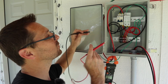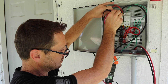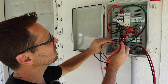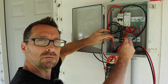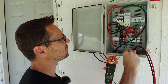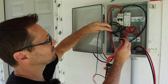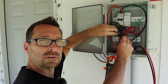I'll show you what we've got coming into our breaker from our panels per our configuration. It's 133.8 volts. If I flip our breaker on here, we're going to measure 133 across these two — 133.7. But if you go next to them, we're at zero. That's why we need those jumpers. We're going to jump between them, plug those in, and we should measure the same going this way — 133.7.